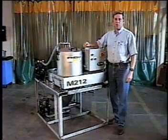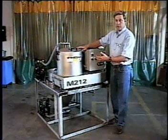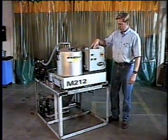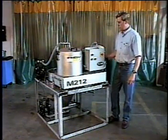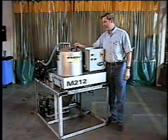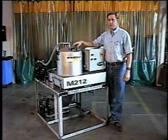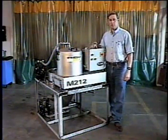This is a more custom manual machine package. All wetted surfaces are constructed of stainless steel, as is the centrifuge bowl. It also includes a stainless steel liner and a more advanced electronic control package. The machine runs on a timer basis, and we also have controls here to operate the air powered feed and return pumps. This machine also has a vibration sensor on it so that if the machine needs to be cleaned out prior to timing out, the vibration sensor will trip and a light will come on notifying the operator that the machine needs to be cleaned out.